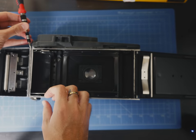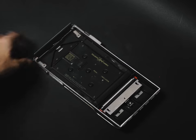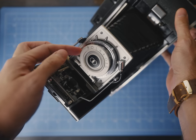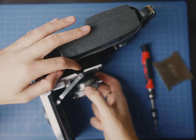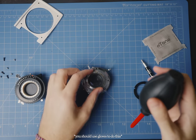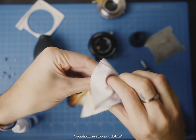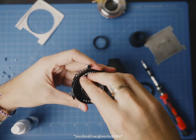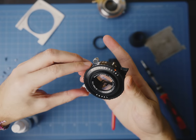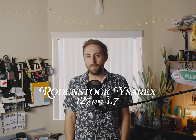There are some hinge bars you'll need to pound out to remove whatever these components are. I also had to remove some additional parts. I took the lens that the camera came with out as well to rehouse it into a new shutter. The shutter on the original was slow and sticky — it only went to 400 for whatever reason, and something with 500 would be nice. I ordered a new CLA'd shutter mechanism and replaced and cleaned the lens elements. And yes, the default lens on the Polaroid 110A does cover 4x5 completely.